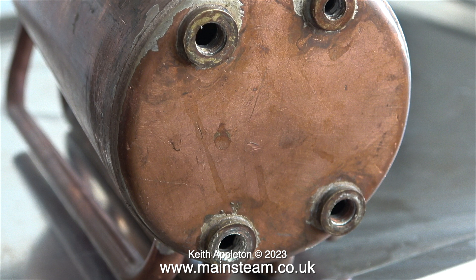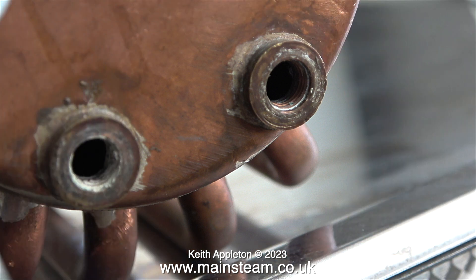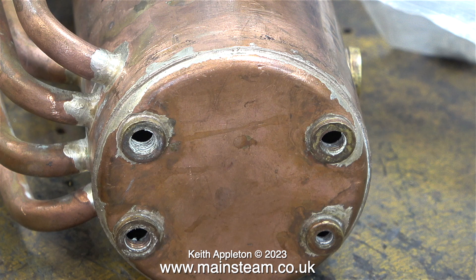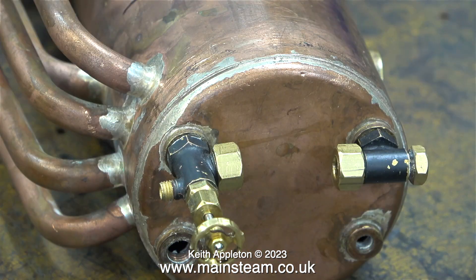One thing I did notice when I took a close look at this boiler was the amount of limescale in the threads in the bushes. A friend of mine gave me an endoscope a few weeks ago - I never thought to use that to have a look inside it. Anyway, as I can see there's limescale all over the place, so if it's external it's also going to be internal. What I need to do now is have a look at the thread forms, make sure they're all in good condition - and yes they are - and find a suitable water gauge threaded quarter by 32 threads per inch. I found this one; it's not new and the paint is chipped, but as I'm going to remove the paint anyway that is not an issue.